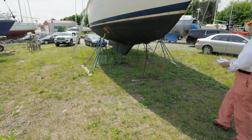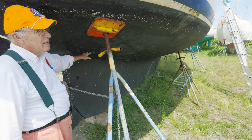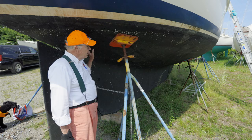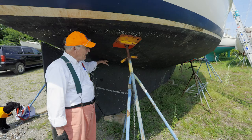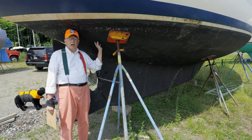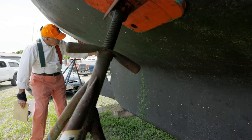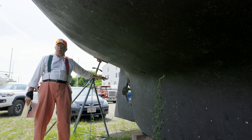The draft on this is five feet. The buttocks extend out about 20-23 percent of the distance out of the boat, and a quarter to a third of the length of the boat forward of the aft end of the stern. When these flatten out, you wouldn't have this curved line coming up — it tends to create a very large stern wave. You can look at Ted Brewer's later designs where this gets flattened out for quite a ways, which gives the boat a little better speed off the wind and downwind.